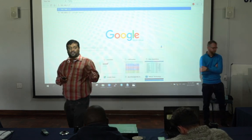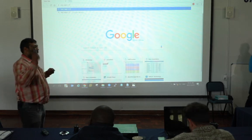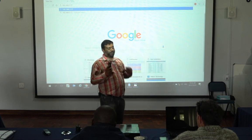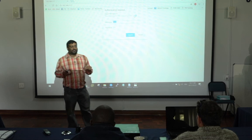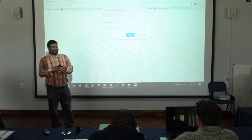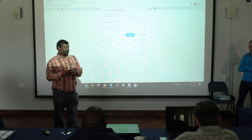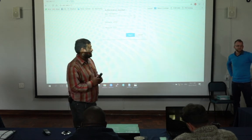Okay, and when you punch in the star 47 star, there is no acknowledgement on the handset. Just press it, and when you hit your last star, it will come up with searching on the screen. So do not get concerned when you are pushing buttons and nothing is happening. We had a tech that we freaked out with because of that. He kept on telling us, nothing is happening. He said, no, just keep quiet. Press the buttons we're telling you to press, please.